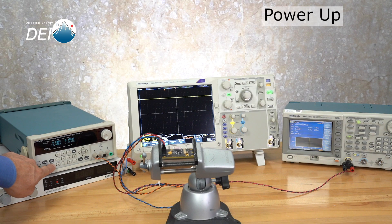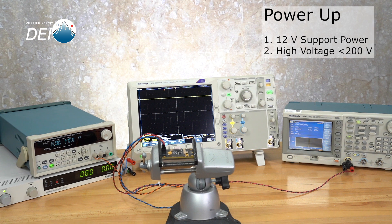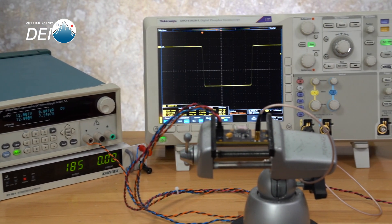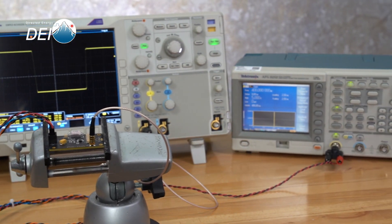The first thing we'll turn on is the 12-volt support power or housekeeping power. The next step is to power on the high voltage power supply, making sure not to exceed 200 volts. Finally, simply enable the trigger source. It will take about 15 minutes for the unit to reach thermal stability, after which you can adjust the high voltage to achieve the current you want, up to the 200-volt maximum.